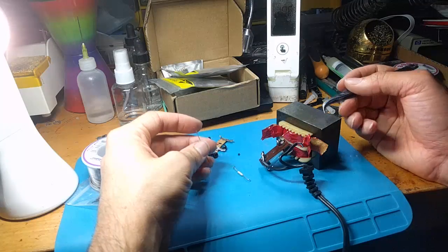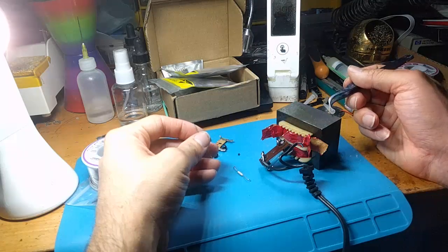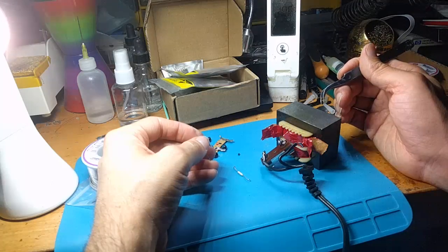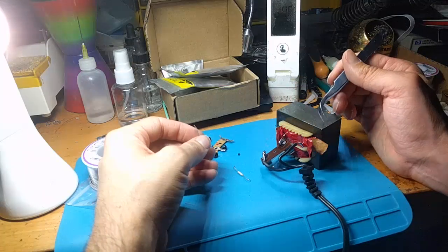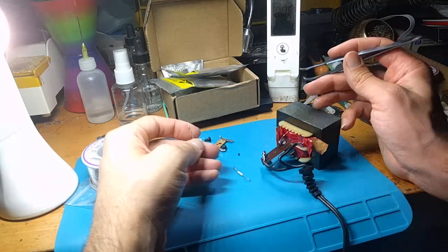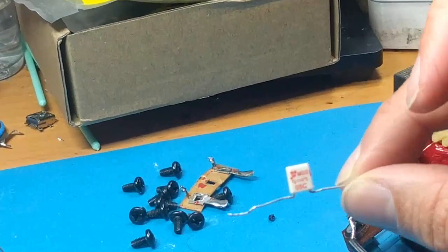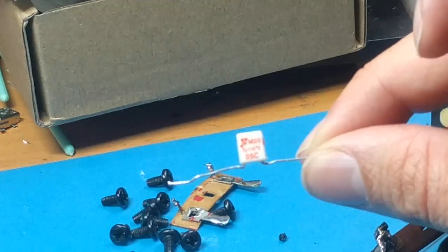So that said, how can these break? Well, sometimes the wire will actually melt inside the transformer, and that's really bad. If you're lucky, sometimes there'll be a break or a melting point from just the input where the fault happened. And this was covered in all this red tape stuff. So I was like, well, with my luck, it's probably melted inside. Lucky for me, and holy shit, lucky for you too if you're watching this video, there is actually a thermal fuse that looks like so, which is on the primary side near the line level input.